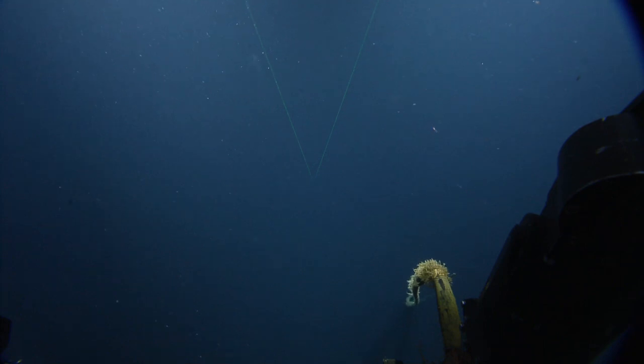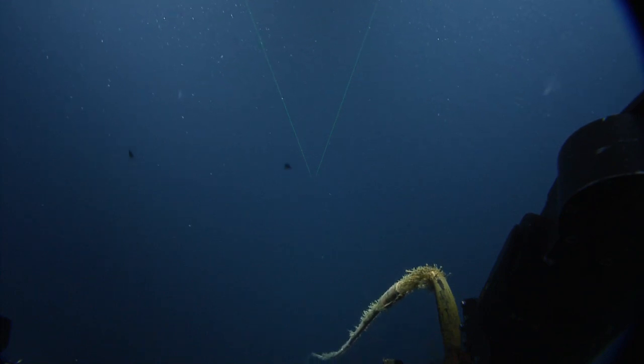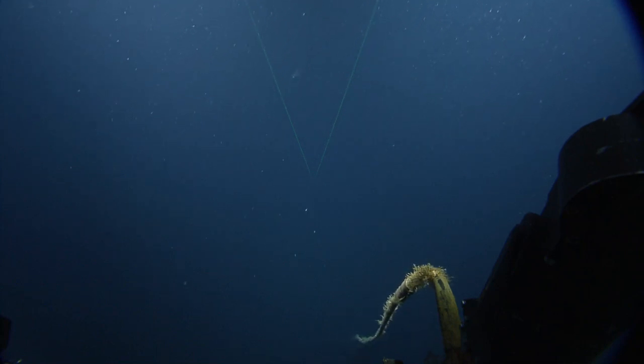Megan, you're good at math, right? It should be 1.4 times on a 45, rise over run. I have an app for that, but it's kind of hard to use right now. But the bullhorns aren't pointing at 45. It's 70 meters long, so if I back up, how far away am I going to be? I need this number for some angle less than 45. That'd be 70 divided by 1.4. That gives you your horizontal distance, minus whatever the bend is to the connector.